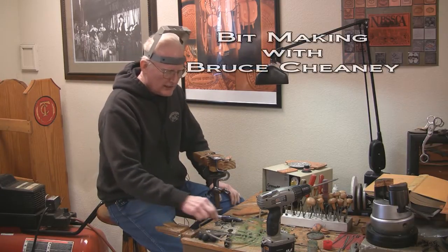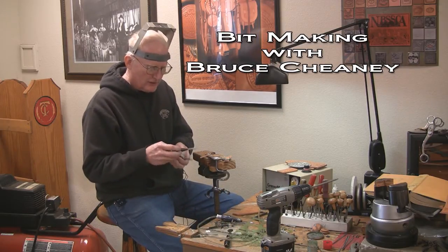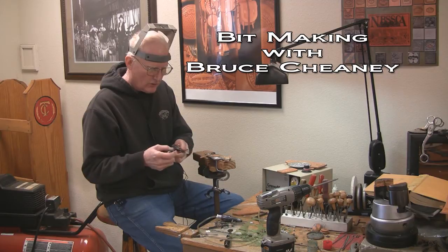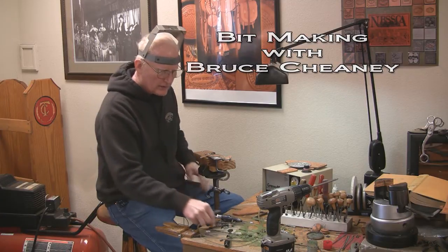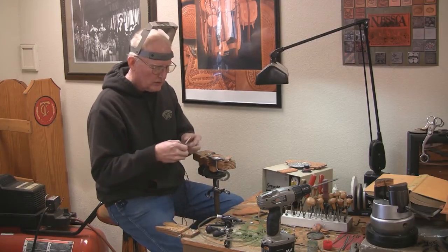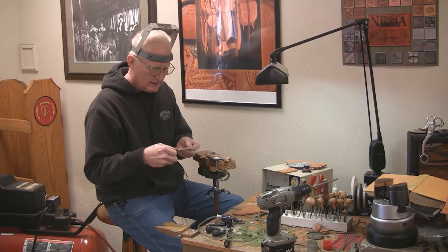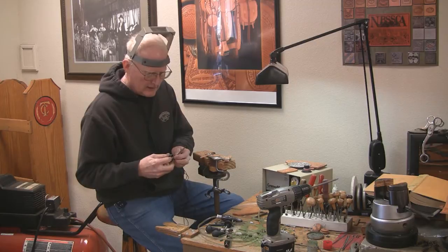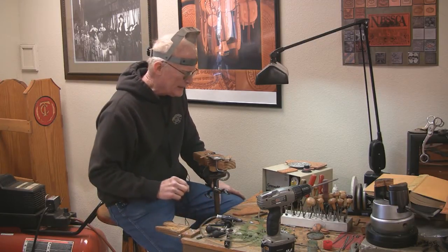I've got my tools here. I've got some flat gravers and GRS handles. This is a 44 flat graver, and I've got a 40 and another 44 to keep a spare around. And then I've got a couple other tools here that I'll put in my handpiece. I've got a 42 and then the N6. Oh, that's actually a 38 flat graver. It's just a real narrow one.